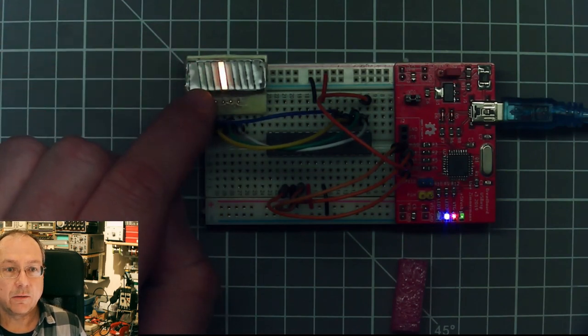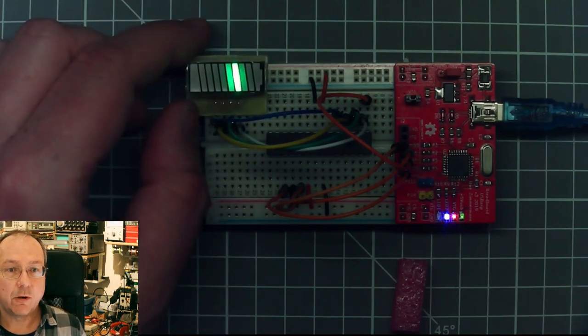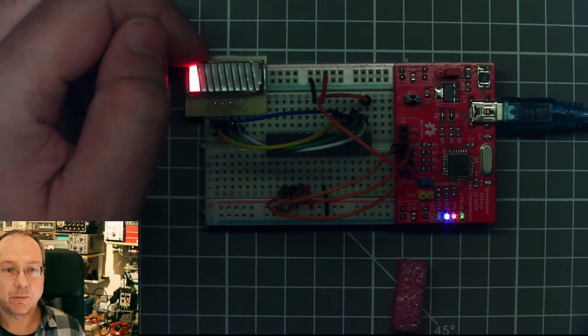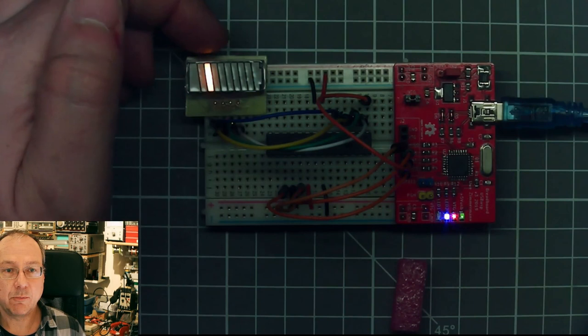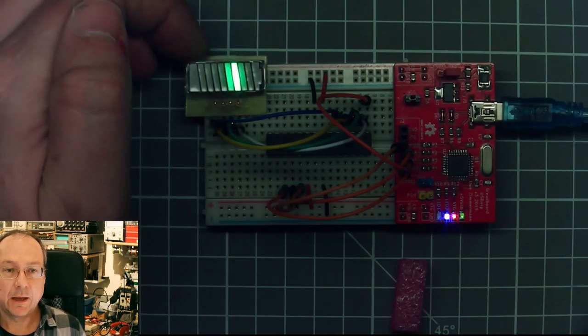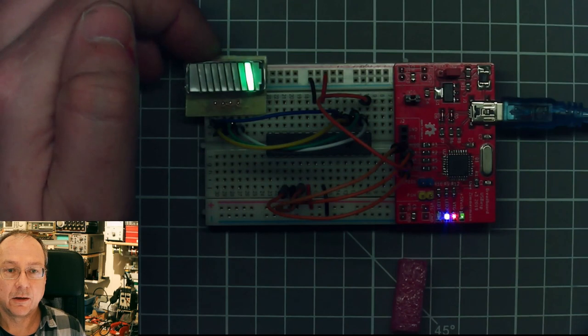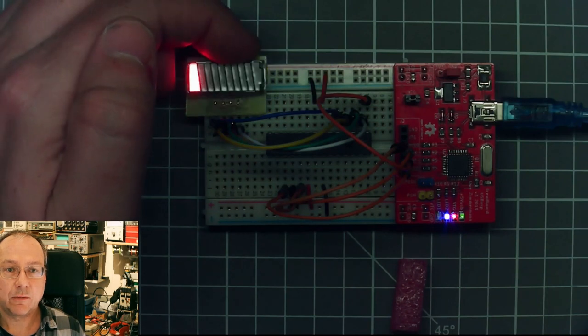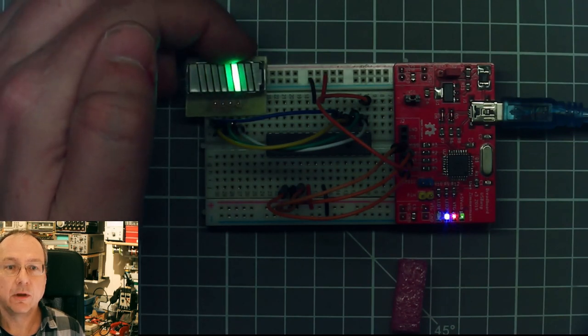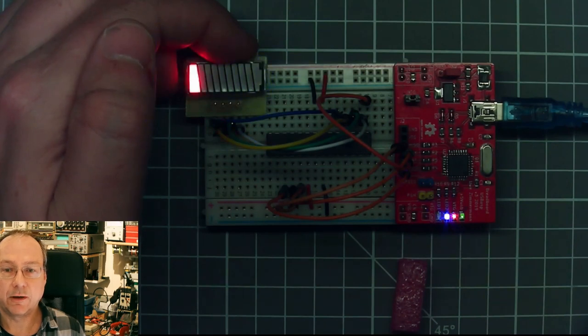So the idea in the project I'm working on will be to actually not only light up one of these bars, but several bars at a time by actually doing some time multiplexing. And well, I think for this video, this is enough, because now you have seen how we can control these individual LEDs in a Charlieplexing with 4 wires.